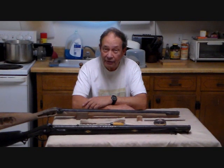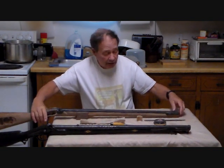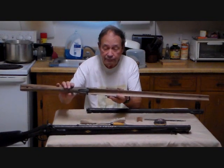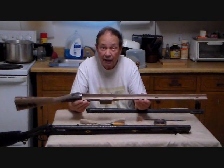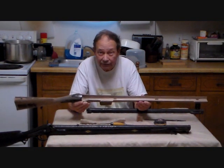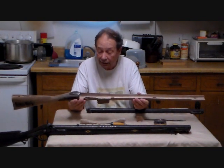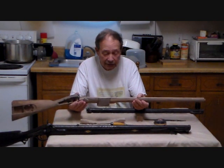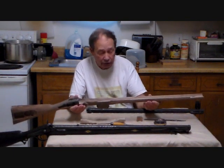Now, nearly 12 hours after we started this morning, we finally got the barrel inletted into the barrel channel. It was touch and go. You'll notice the indentations here where the barrel lugs fit. You gouge a little while, sand, dig a little bit about the barrel lugs, put it back together, see if it fits, and it sinks lower and lower down. Finally, we did cut this notch — we inletted for the bayonet lug. We have it fairly well along, and this is getting quite thin indeed. We have to be very, very careful, and I managed not to split anything, which was good.